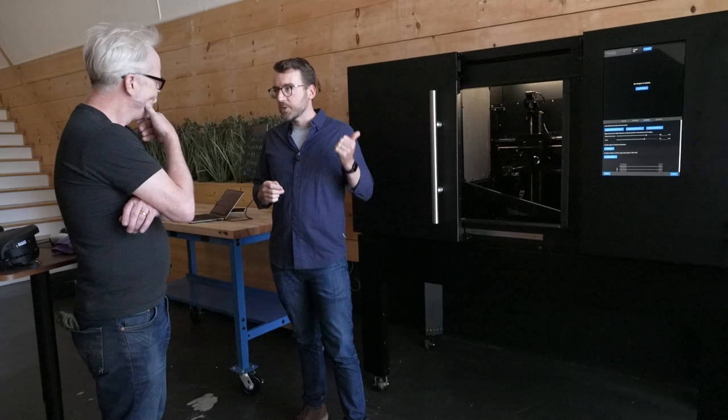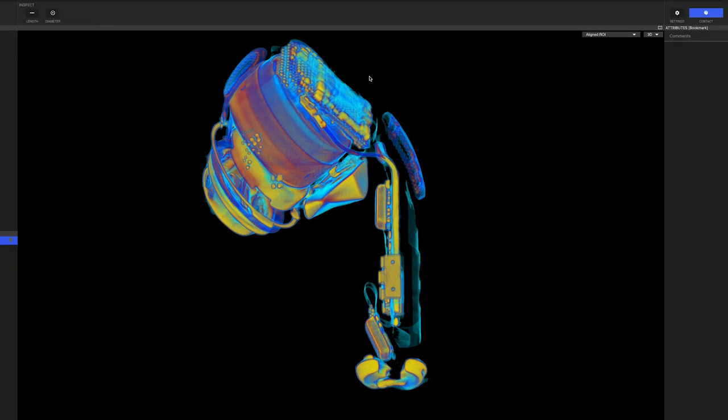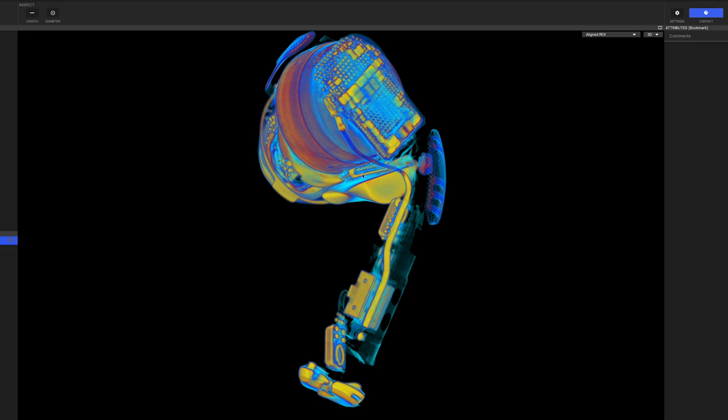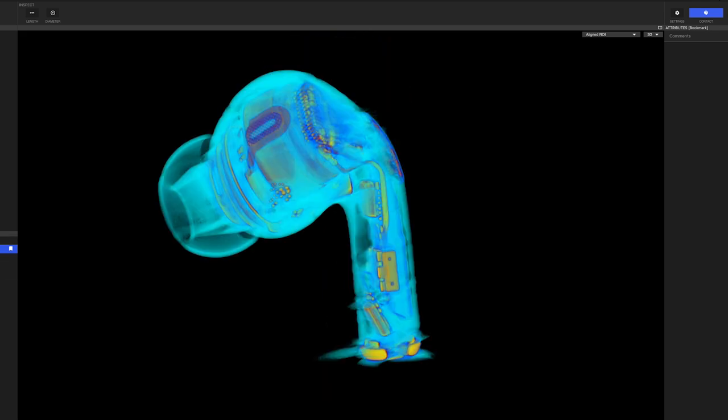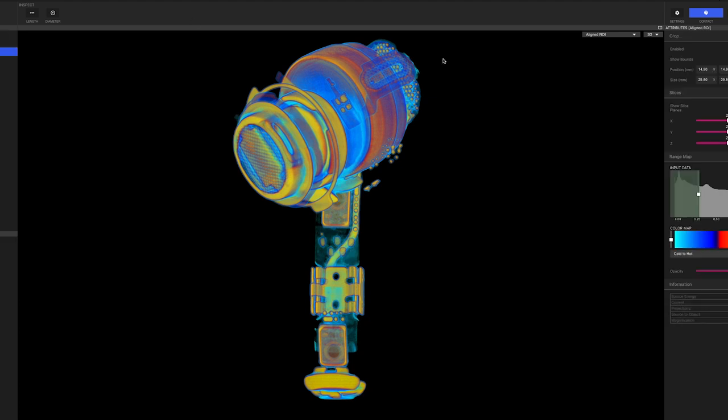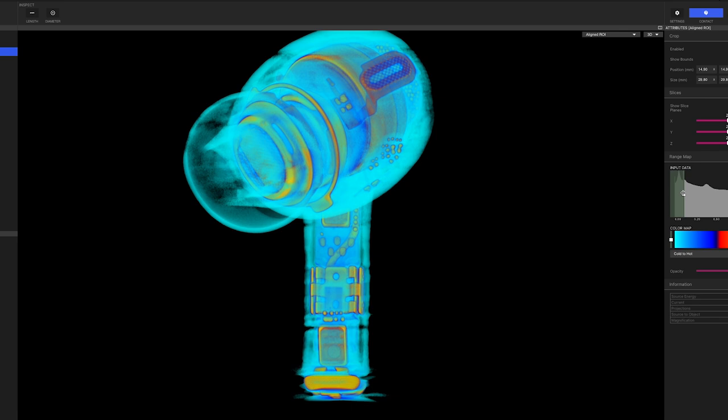What sort of detail does it give that's better than just a straight X-ray? What we have that's different is three dimensions. Just like a medical CT scan, we take two-dimensional X-rays from a lot of different angles and use software to reconstruct those into a 3D model — sort of like the way photogrammetry works, using a drone to fly over somewhere and take photos from different angles reconstructed into a 3D view. We're doing that with X-rays so you can see all the way through. You've got a full 3D model of your internal and external features. What shows up in an X-ray is density — different materials of different densities can be distinguished, and you can look at them separately and see how they're fitting together.